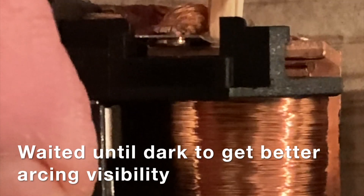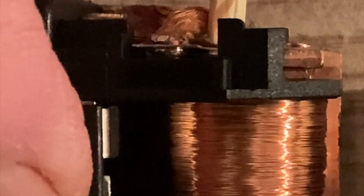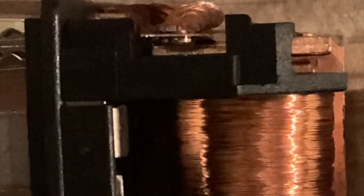It's a little hard to see with the lighting, so I zoomed in more to get a better idea of what's going on. You can see there's quite a bit of arcing — both with contact and with release. I don't think it's just back EMF; you're getting contact arcing as well during the initial closing of the contacts. During normal actuation it's probably a faster open and close, so this may be exaggerating the actual amount of arcing, but there's definitely arcing occurring. Here's a really good release arc right there — so it's definitely occurring.